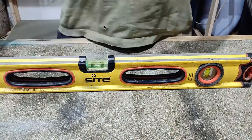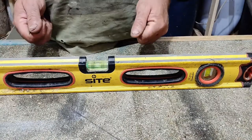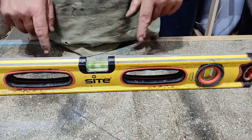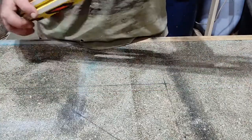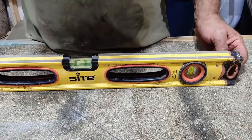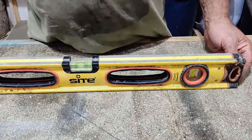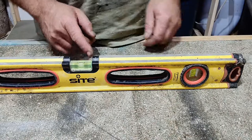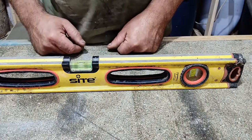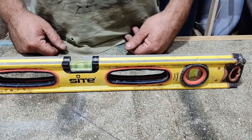But to check it — let's say for instance we were on an incline and the bench was tilted — we could turn it around, and if the bubble is still in the same position, you know your level's correct. Your bench might not be, but your level's correct. So I'm going to turn this around, line up exactly where I had it last time where I marked the ends and the line on my bench — exactly the same place. I then check the bubble to see whether or not it is in exactly the same place, which it is — pretty much bang on in between the central marks of the spirit level.